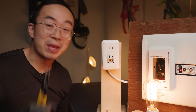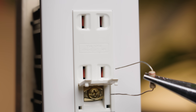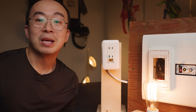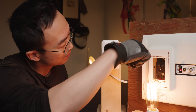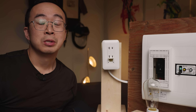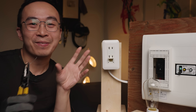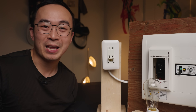Let's see this in action. I have a resistor in my hand, and I'm going to stick it between hot and ground to simulate what happened when electricity leaked in our toaster. By the way, this is dangerous — don't do this at home. It worked. The energy was safely sent away and the circuit turned off, stopping anything from injuring you.